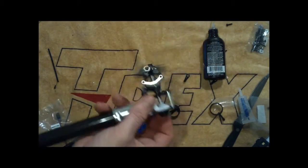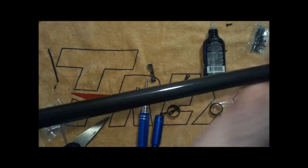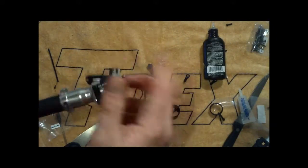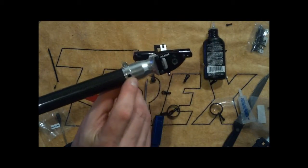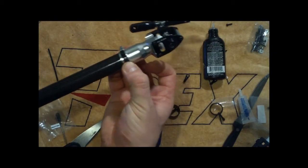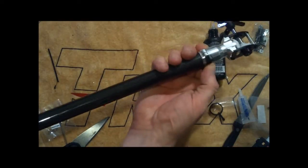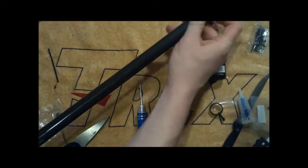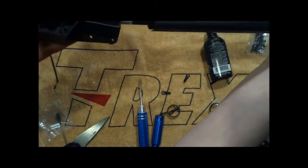Okay, so see, now that I've got the gears in place, you can turn the torque tube in the front, and you've got this moving in the back. You're going to end up lining up the holes here with this and putting the fin on, and then after we do that, put this in the front block.